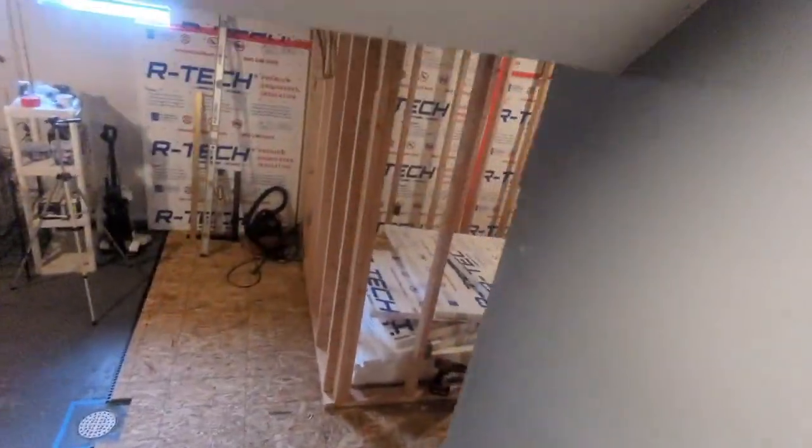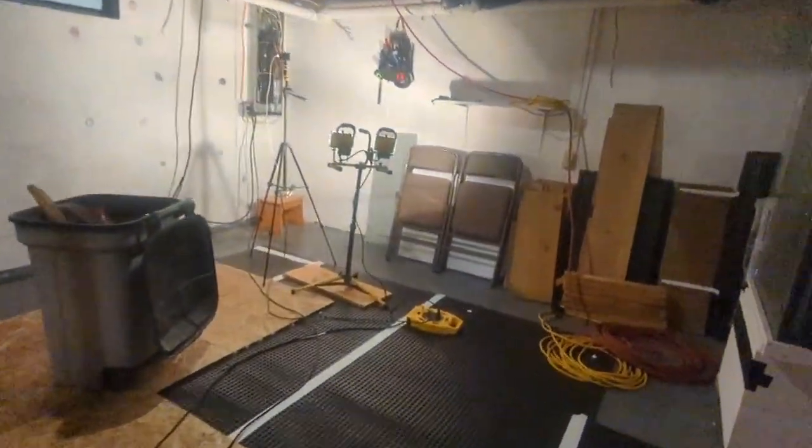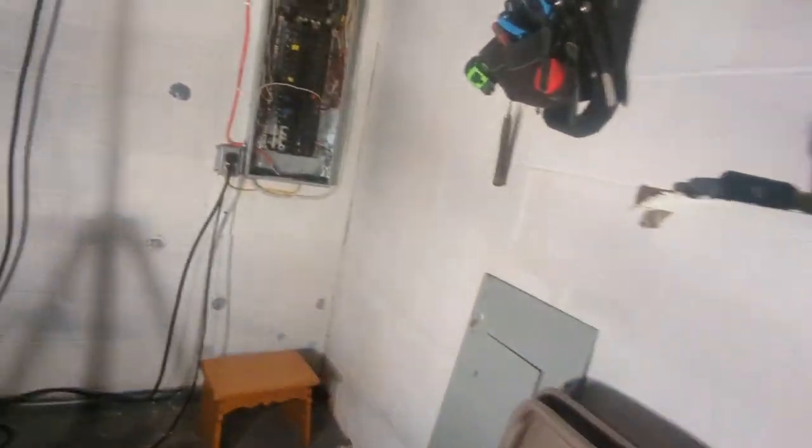Circuit should be on its own. The bathroom should be on its own, and possibly be 20 amp, because sometimes these hair dryers and stuff draw a lot. You get a hair dryer and curling iron and all that other stuff plugged in. So we got that figured out. That one wire feeds the whole bathroom and three outlets in our bedroom. So we're good there. We'll go ahead and unhook that, take it out of there.